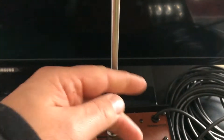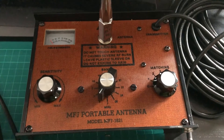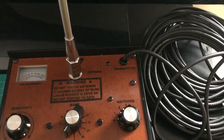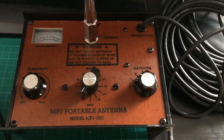This also comes with a neoprene sleeve for the antenna. I would imagine that is just there to protect against coming into contact with the antenna and getting some nasty RF burns. This will deal with a max power of 200 watts, believe it or not. Not that I would want this sat next to me anyway — hence why you've probably got 50 feet of RG58 when running 200 watts. Not that my license conditions allows me to do that anyway.